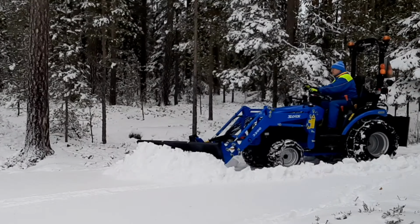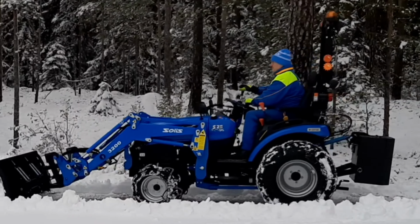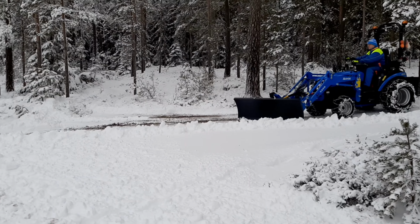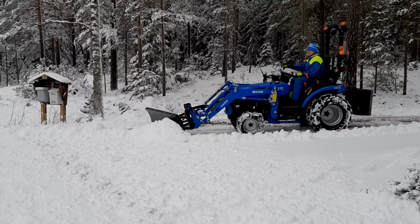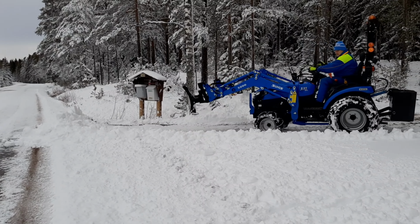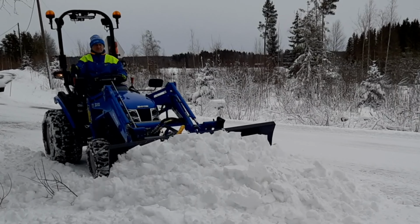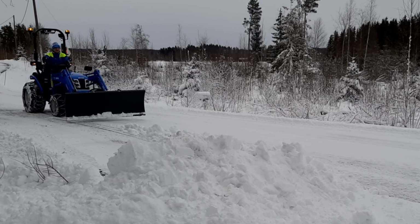Testing during the day, the snow that fell at night on the melted ground posed a challenge to the floating of the snow plate. The cone shape of the float worked surprisingly well. The plate floated easily and the front loader did not have to be constantly adjusted. The spring adjustment of the spring load was at a minimum and the push feel of the snow plate was stable.